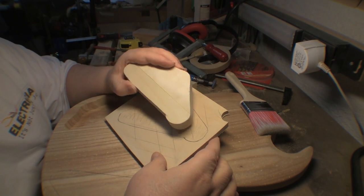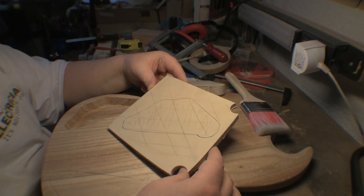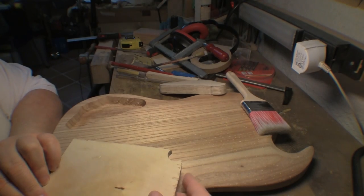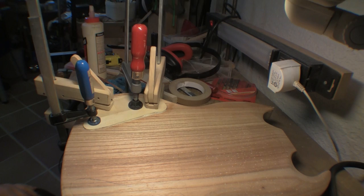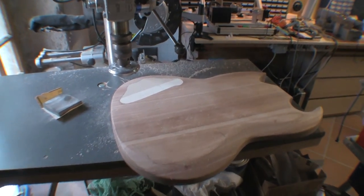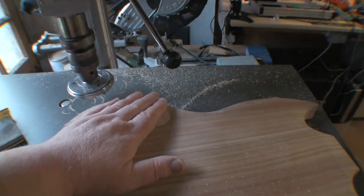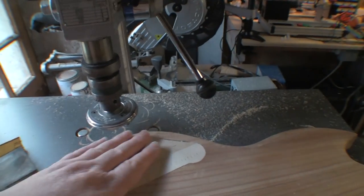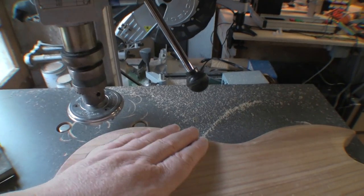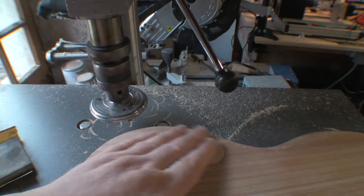Before I glue it all up, I'm going to cut out the shape on this piece of ply as well, and that'll be my router template to use later and make it a lot easier to route out the new cavity. Okay, we'll let that glue up for a while, and now we sand it down. There's the plywood plug fitted into the original cavity I don't need anymore — I just planed it off level. To make sure everything is nice and flat with no over-enthusiastic sanding of the edges, I used the rotary plane. It's the handiest way of doing that.